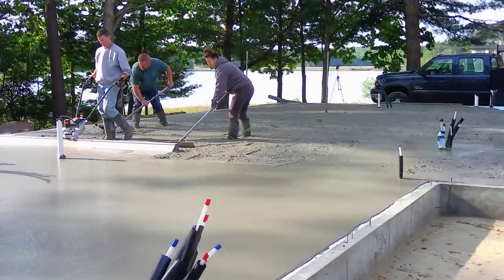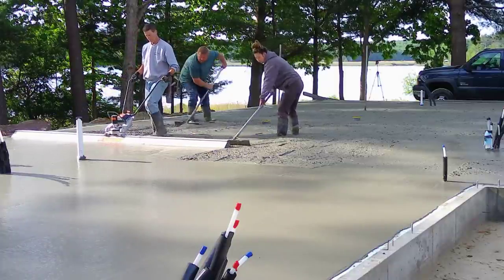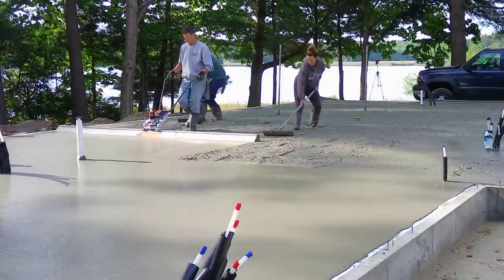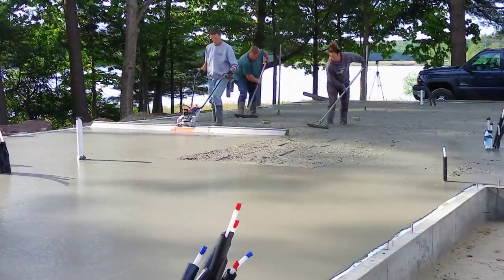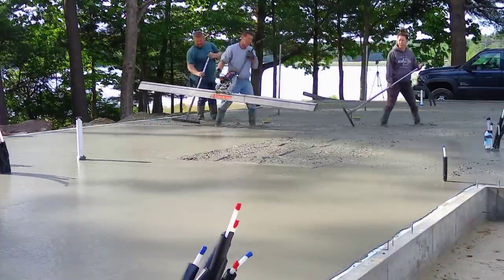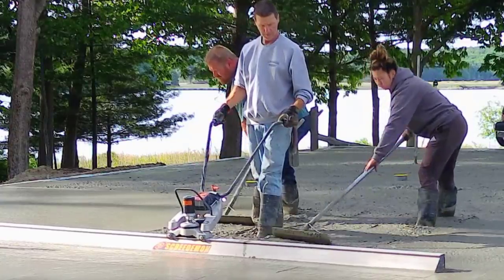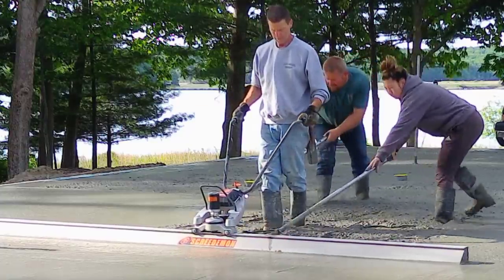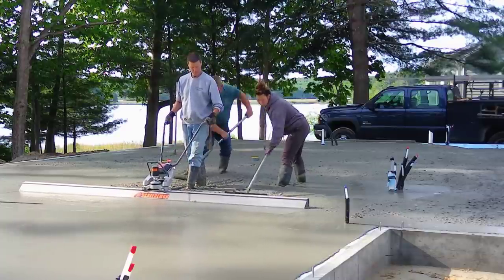You can see how nicely that pulls back. I've got a link for the MBW Screed Demon down in the description if you want to check it out. MBW has this battery-powered one — we put a Milwaukee battery in there, just a five-amp battery. You can put bigger ones in if you want; I've never had trouble doing a whole floor with just the five-amp, never run it out. They also have a gas-powered one that works really well. We use their power trowels too, which are really good. The whole unit is probably 35 to 40 pounds with the 12-foot board on it. You can also get 14-foot or 16-foot boards, or smaller ones — we generally like the 12 for most things.